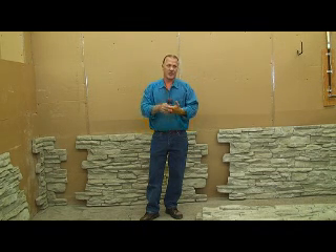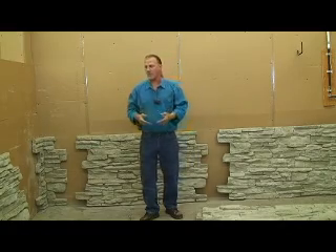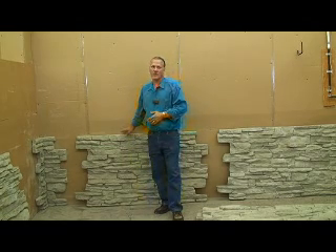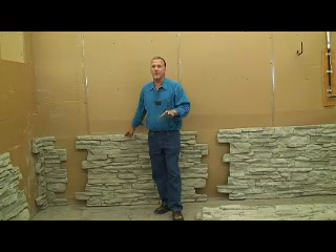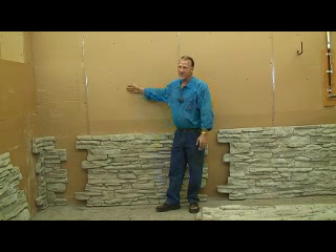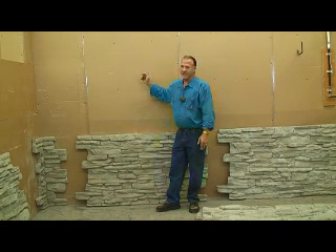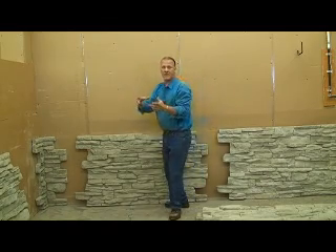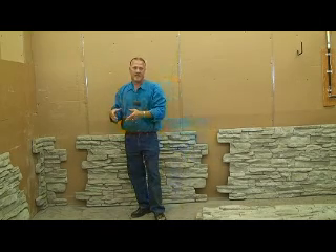In callbacks, logistics of trying to get rock together without it busting or cracking or leaking in the case of water features, synthesizing rock has always been the better. Look at cultured stone that's out on the market and has been for 35-plus years — it's nothing new. We call it the lick-em-stick-em. You take a vapor barrier, put yourself a scratch coat with a chicken wire, and you start mortaring one rock on at a time. These rocks, depending on the manufacturer, are 800 to 1,800 PSI — not 12,000.